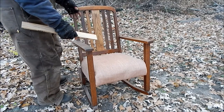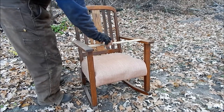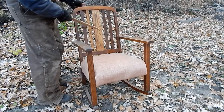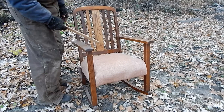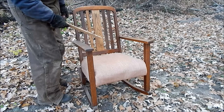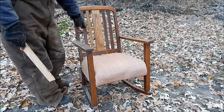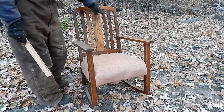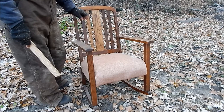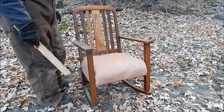I'd like to have videoed it, but it was a nerve-wracking operation. I should hang on to this spare one just in case, but they're pretty tough — I don't know how they broke them out of there. You'd almost have to put the chair down and jump on it, because this one was sheared off. I lucked out in that it was not glued. These aren't glued in there, they're just stuck in there. The little stub end that was in there, I drove in at an angle with a chisel and popped it right out in one piece. So that worked good.